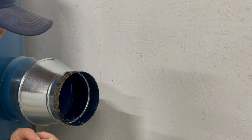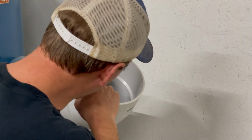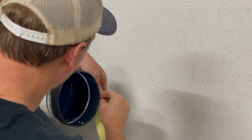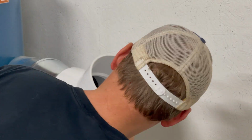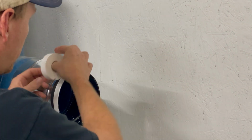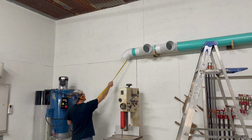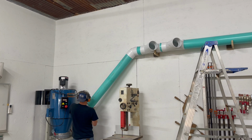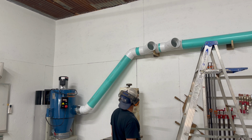So next, that takes us to pipe selection. And there's a lot to cover here, and I can say a little bit about this having been through all of it. I chose what is called SDR35 sewer pipe, and I chose this because it is thinner and lighter than regular PVC. Schedule 40 is what you would typically buy from the box stores. This stuff is cheaper, and it was about $350 cheaper, in fact, to go with the SDR sewer pipe than the standard 6-inch Schedule 40 PVC pipe.